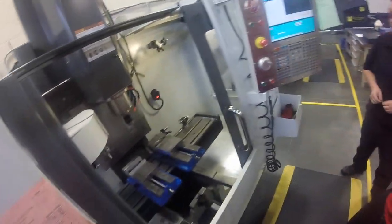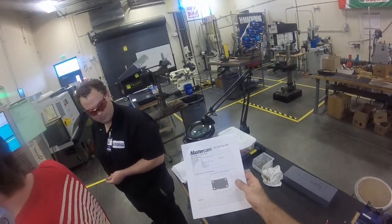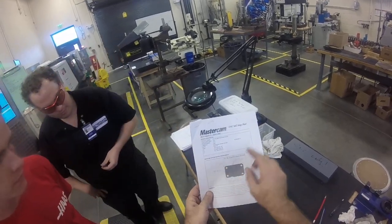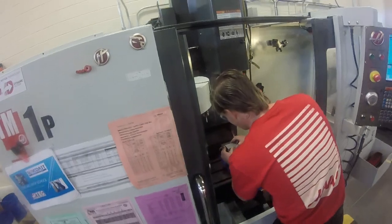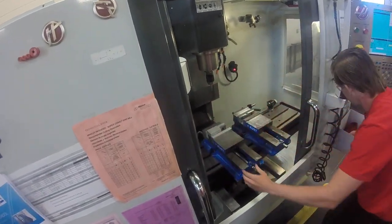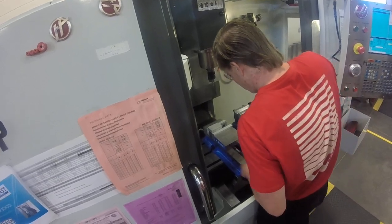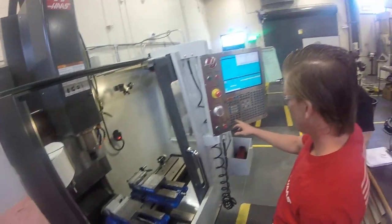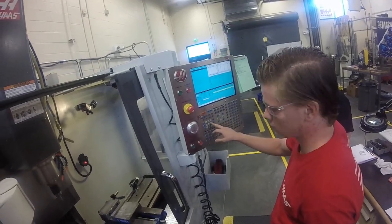We need to put a piece in the vise. We're using soft jaws — we've got some material already cut for this job. Bring the table closer to you, it's always pretty helpful. We're doing this job here, programming in Mastercam. We need to get this upper left coordinate, and we also do a work shift afterwards. Here's our coordinates: G54, X, Y, Z. We're going to go flush to the left edge for our loading position. Soft jaws cut about 200 thou deep so we have enough material to cut around the whole piece. We can do this with the door open so we can turn on the spindle — hand jog, large or extra large — and pick a direction.